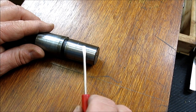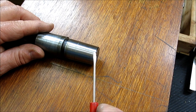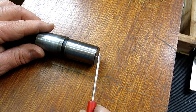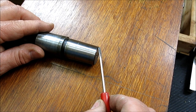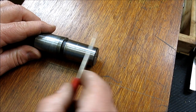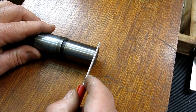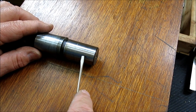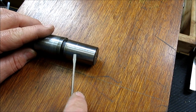When machining a taper, you can't just measure it with a two-point measuring system like a micrometer. How do you measure that corner? There's a big chamfer on there. What the specification calls out is the theoretical sharp corner where a plane intersects the taper, and another plane intersects it at the other end — and it calls out those diameters. So how do we check that, and how do we check this angle? It all has to come together at once.